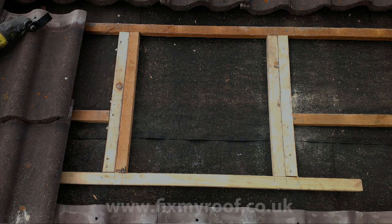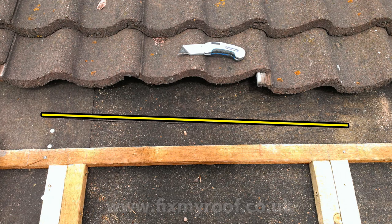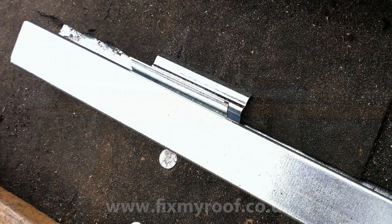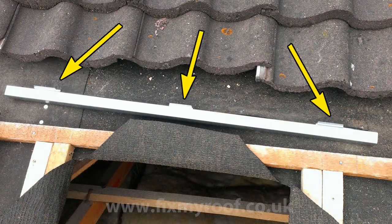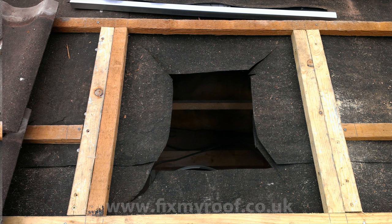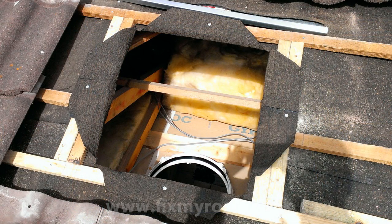The frame is now complete. Its job is to support the external window unit and not foul the reflective tube — it's as simple as that. Next, cut the membrane or felt above your top batten at a slight angle to create a shallow slope, then slip in the supplied metal gutter and fix it in place. Two of these metal gutters are provided and they interlock in case of a large span between trusses, but here I only need to use the one. Now clip in the under-sarking clips into the metal gutter to secure the membrane or felt into its position.